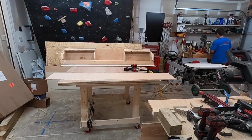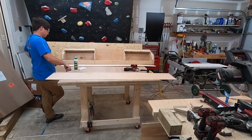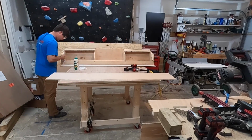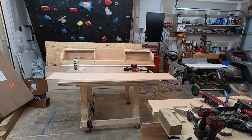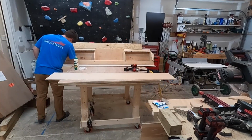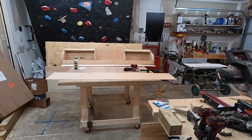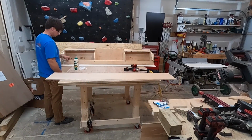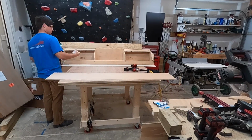So when we're installing our cabinet backs, we went with a glue and staple method. I've got a pneumatic staple gun. It's a relatively cheap staple gun, like 30 bucks. We'll put a link in the description below. If you have an air compressor, I would highly recommend this gun. It's super fast, super easy to use, and it has saved us a lot of time on our van build, being able to staple things together really quickly.